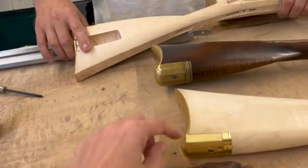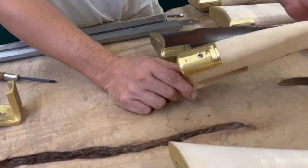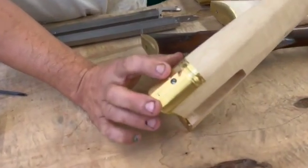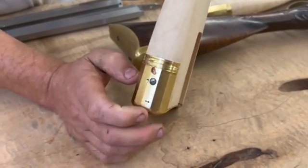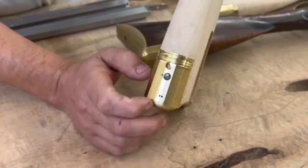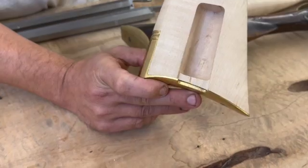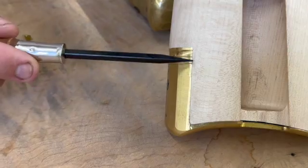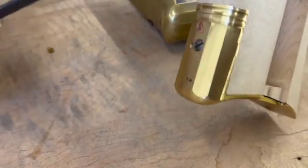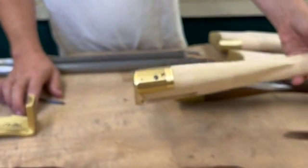This one you can see in the video was like a test piece because it's got holes in it. That was one we poured that had some slag inclusions, so they didn't clean up. But that's one of the first ones we did — usually you mess something up, which we did. We messed up a little bit of the machining on it too. But that's on a sample, one of the first ones we did. The first ones you always pick ones that have defects so you're not wasting a good piece. That wouldn't be in the final version.